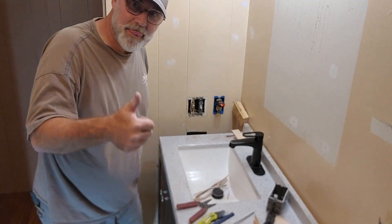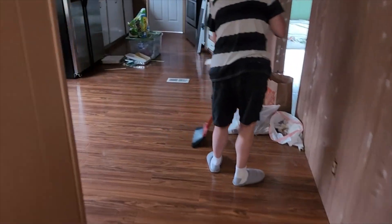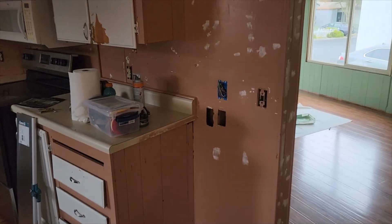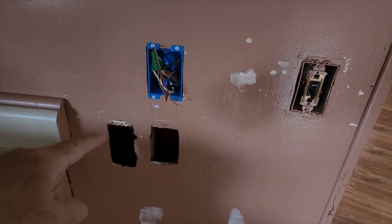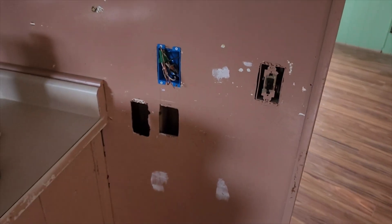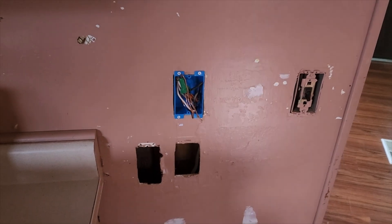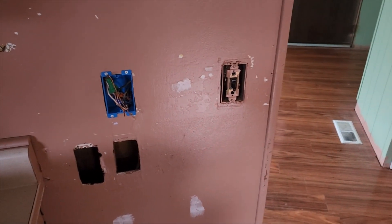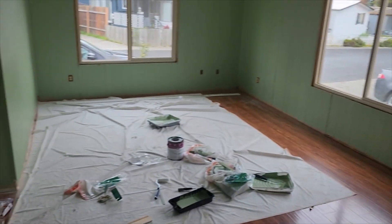I was able to get everything moved and patched up. It's a little dark — let's turn the light on — you can see the patch right there and the other one way back over here. I'm going to have to get another deep or shallow box because there's too much going on in here — a wire coming from the top and one from the bottom. I'm not going to worry about the two holes that will be behind the cabinet, but I'm glad I checked because I found some loose grounds and one outlet had a backstab that wasn't connected. Replacing all the switches and outlets gives me a chance to check all the plugs.